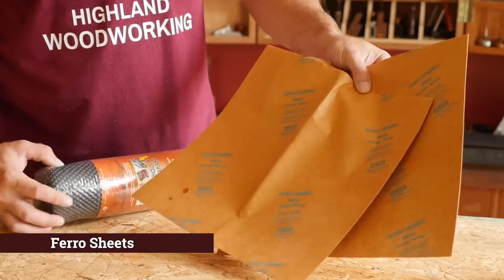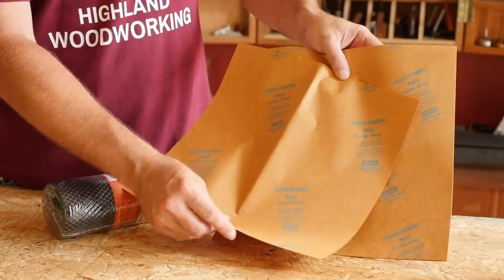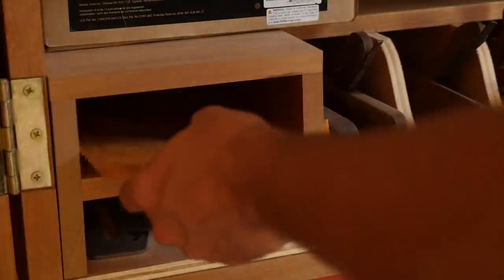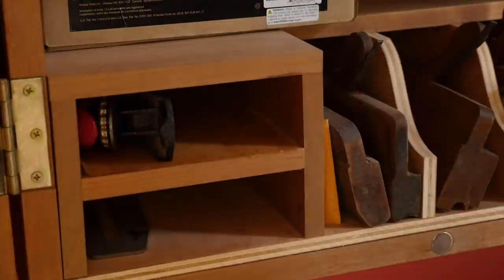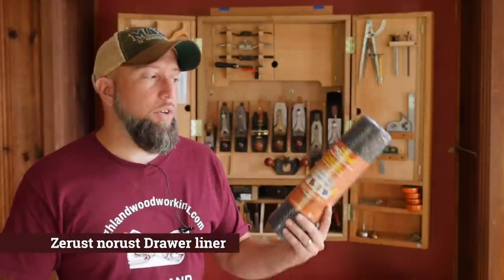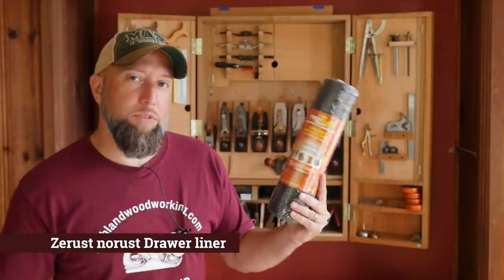Next up are products that reduce moisture in your cabinets and drawers. Drawer liners and ferro sheets are great for enclosed spaces. Impregnated with a corrosion inhibitor, they release slowly to help fight corrosion on steel, and they're easy to cut to size for your drawer or area in your tool storage box. Here's something I learned the hard way about drawer liners: the part about being impregnated with a corrosion inhibitor is extremely important. You might see some drawer liners that look just like these and think you'll use them to line your tool drawers or shelves — which is exactly what I did. My experience was that it trapped moisture and held that moisture in contact with my tools, which resulted in a tremendous amount of rust. So if you're going to use a drawer liner, make sure to look for something that says it prevents rust and corrosion.